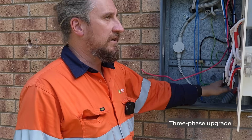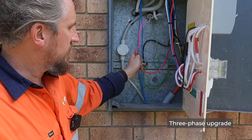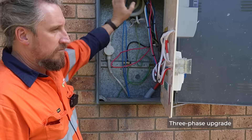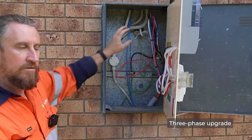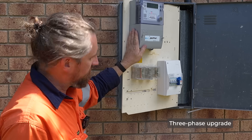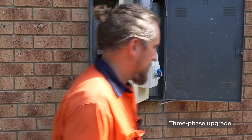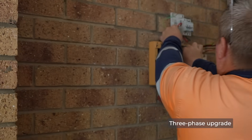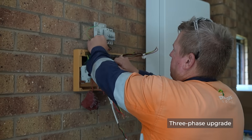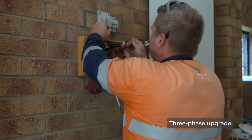The three-phase upgrade was completed by one of our teams at an earlier date. Since then it's been running on single phase, which we've just got locked out for the moment. We're going to replace the internal board with a larger board ready for three-phase loads. He's just organizing the different circuits here now so we can get all these old ones removed and then we're going to put new RCBOs and RCDs on all the different circuits.